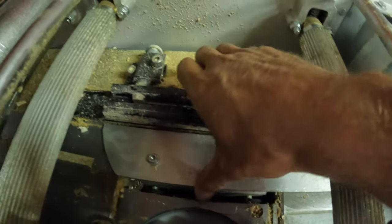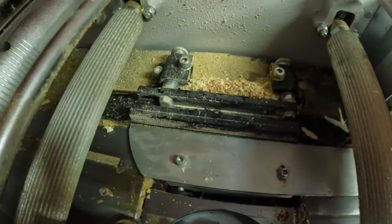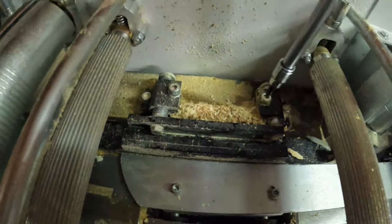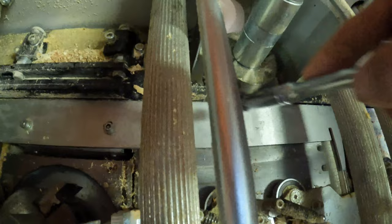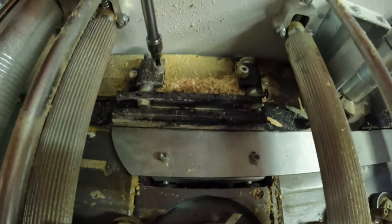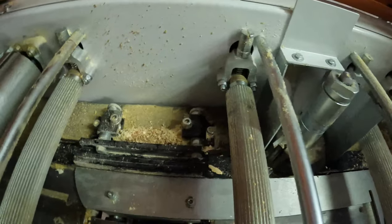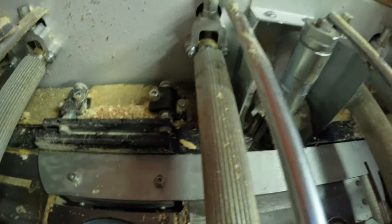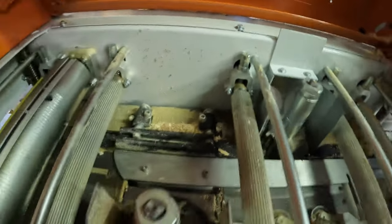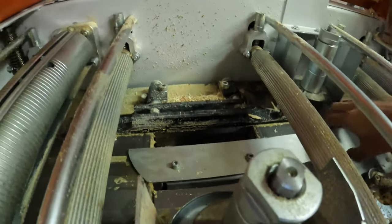For this back fence, you move it up until you just touch the guide. This is hard to do one-handed, and honestly I'm going to go back after filming and fine-tune it to get it perfect. You bring it up till it touches your guide, and now as the material comes through the cutter head, what's left should hit that fence and be perfect. Tighten this fence up. Now the wood's going to come through, get two millimeters taken off, ride out the outfeed fence, and go right through.